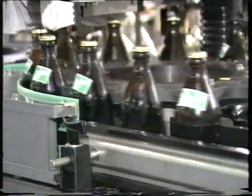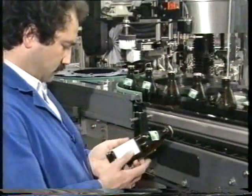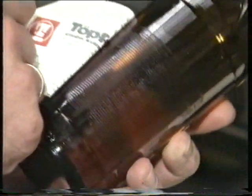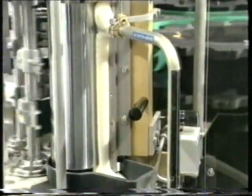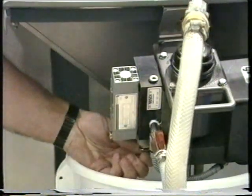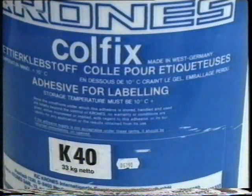The glue to be used is largely dependent on the machine speed and its processing characteristics. The quality of the glue should be such that it can be applied thinly to the roller and must not splatter. It must be pliable and easy to handle by its processing components. If the temperature and quantity of the glue is correct, the label should adhere firmly to the bottle at discharge. If the label floats, the drying time is too long or the water absorption of the paper is too low.